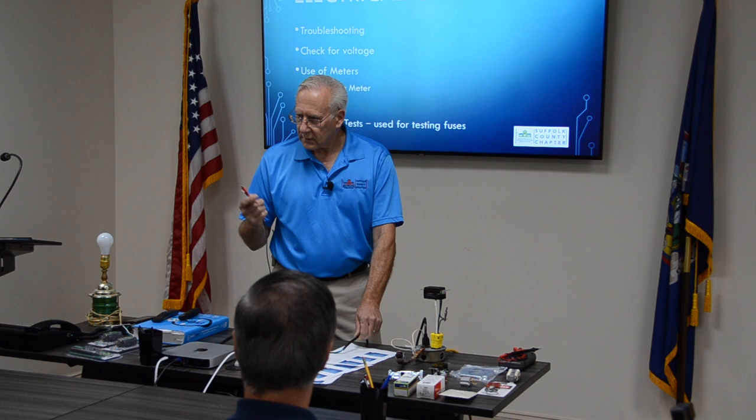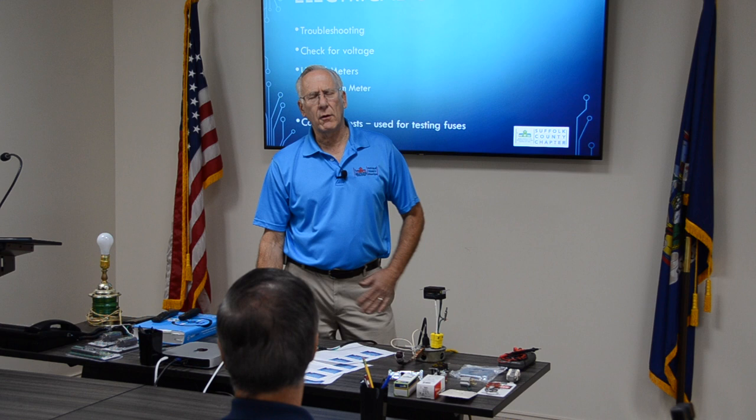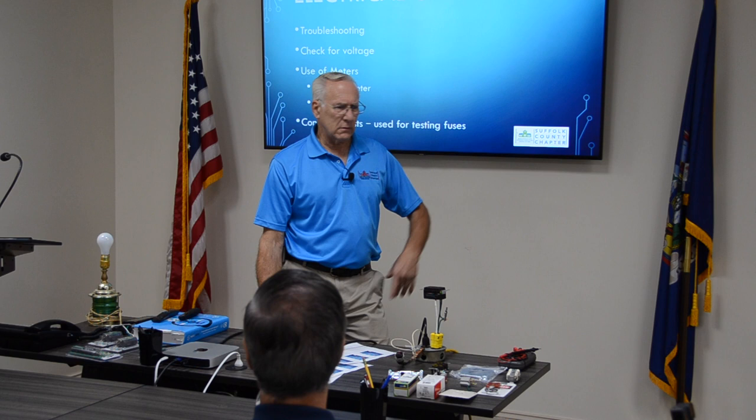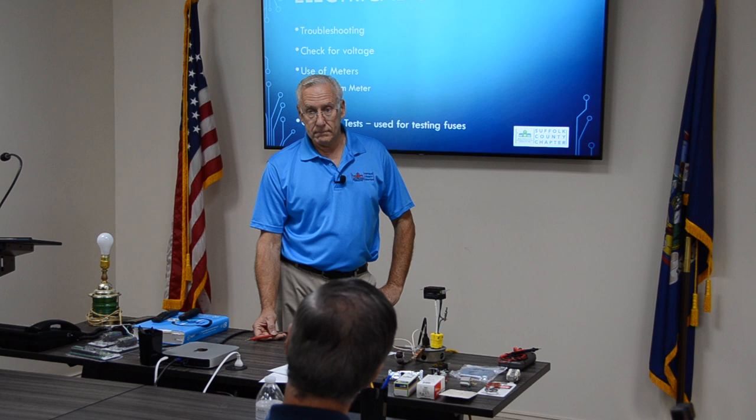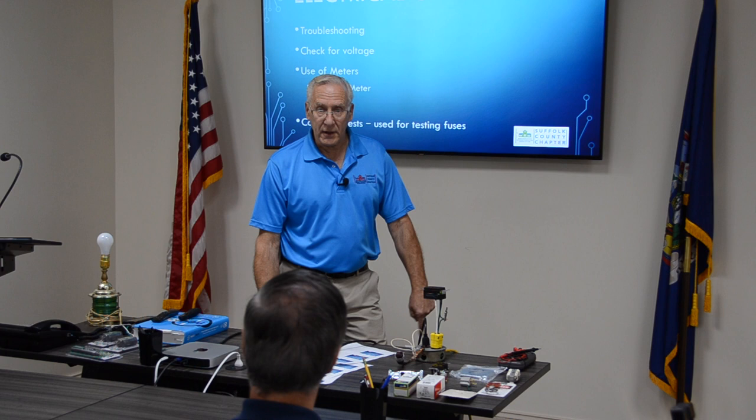So now, if you were testing something, and there was no ground hooked up, where would you... Well, how can there not be a ground? You've got to be around a piece of steel. You've got to be around anything. The boxes that are in commercial work are usually made out of metal. Now, if you're outside, technically, couldn't you put it into the ground? Absolutely. As long as it's a good connection, a ground rod or a piece of steel in the earth, absolutely, because you're standing on it and you can get electrocuted.